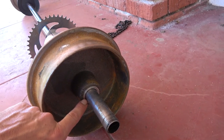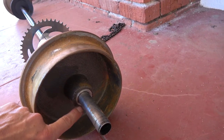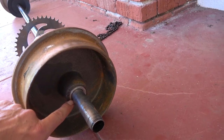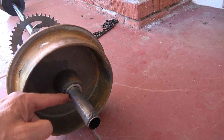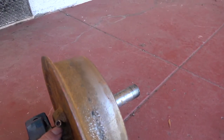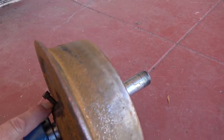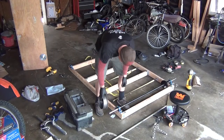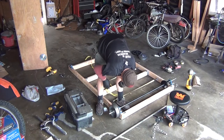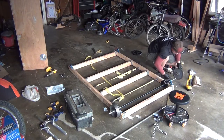These wheels came a little bit too big, so I had to bore out the wheels and make a bushing so that the ID would be 0.990 and the OD would be — I think I made it 1.450. To keep the wheels from spinning on the axle I drilled and tapped a quarter-20, put a little point on the end of it and a little divot in the bar. So I don't want the wheels spinning on the axle and I don't want the bearing spinning on the axle, so it's all connected.